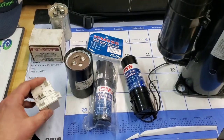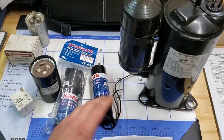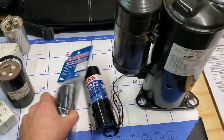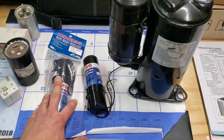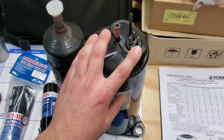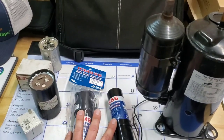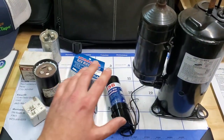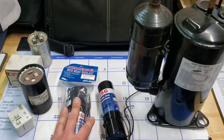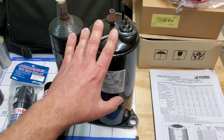If your capacitor is going bad, that can definitely cause the compressor not to start efficiently. If your potential relay is stuck, this can not only affect the compressor's longevity but also keep it from starting. If the capacitor and potential relay go bad, you can replace them with this hard start kit device — usually around $50 to $60. You really need to know that the current from this compressor can definitely cause your lights to dim. It's good to get maintenance once a year to make sure you don't have any faulty components. If you get these components checked and make sure you have a good starting apparatus — if you don't have one, get one installed. A typical service call and part could be around $150 to $200, depending on your area, and this will keep your equipment running in tip-top shape.